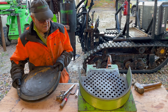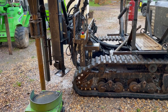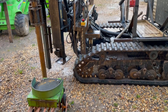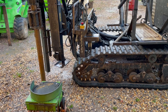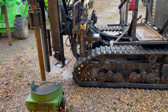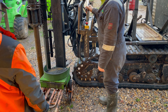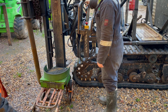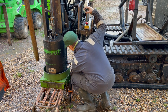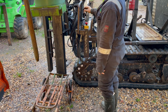We've got our new guard on. The next step — we put the top back on. Dad has finished bolting the top back onto the plate. We set up with the rock spike under the weight to prevent any harm, and we wheel the trolley with the post plate underneath. We lower the telemast back down through the plate so it reattaches with the weight once the rock spike is removed. Once she's back onto the mast, we put the final retaining plate on the very bottom — the same one we showed how to take off — and the job is done, ready for the next service.